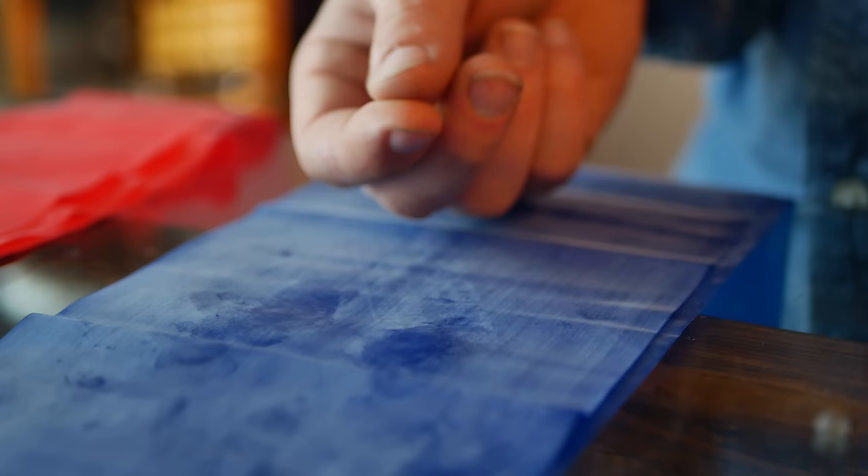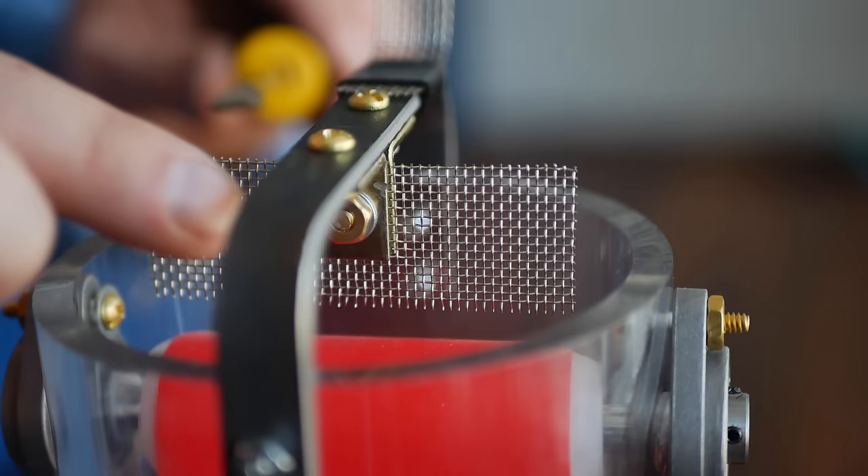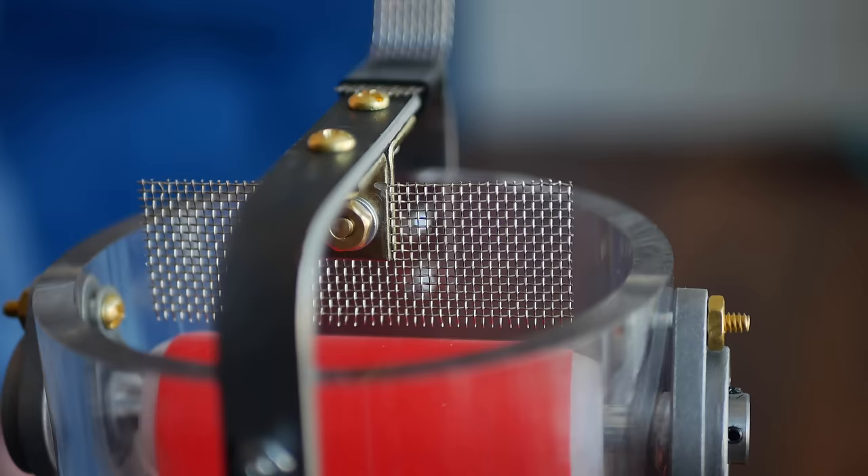After a bit of inspection I realized the latex belt was just too thin and came covered with chalk powder. Switching to the neoprene belt, which was much thicker, helped a lot — I was getting sparks upwards of 2 to 3 inches, which really got me excited. But a 12-inch sphere is supposed to develop 450,000 volts, so it needed more work. I tweaked the upper comb, adjusting it closer to the belt to encourage easier charge transfer — same for the lower comb. Adjusting the combs made the biggest difference by far. After cranking up the power to 40 to 50%, this beast was pumping out 10, 11, 12-inch sparks — exactly what I was going for.